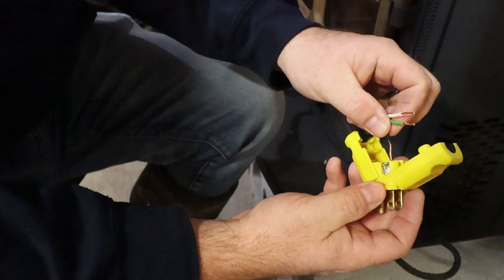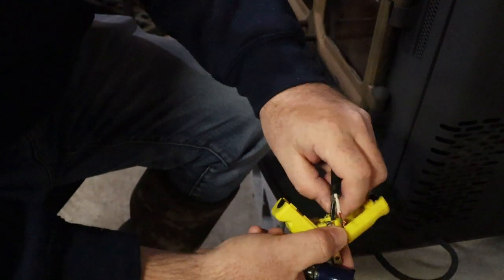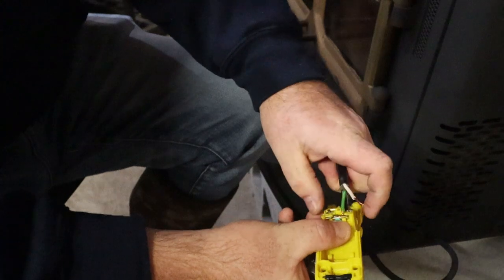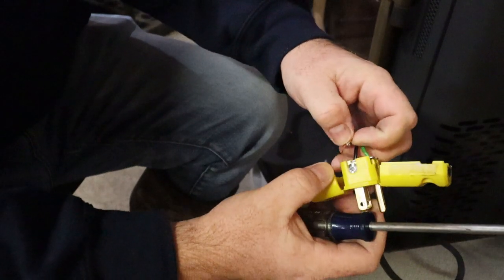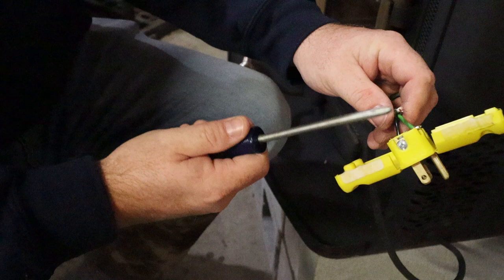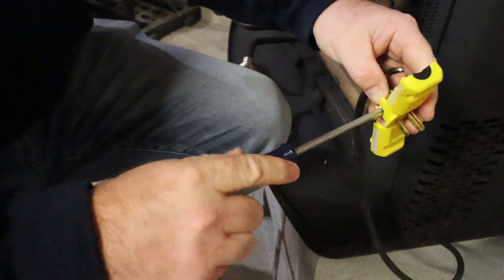We're going to start with the black wire first — and make sure the other end of the cord is not plugged into an outlet. Tighten that down firm, then go with the green so I'm not fighting that middle wire later. Get the ground wire hooked up. Remember: white is neutral and silver is the neutral side of the plug. For any UL-certified plug that is code you must follow. I relate silver to white, and black and gold go together.